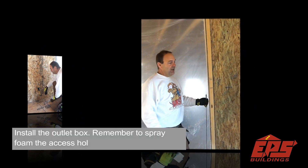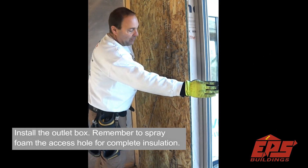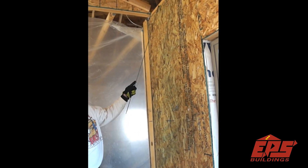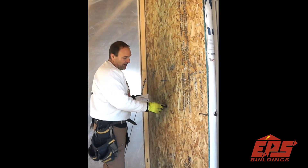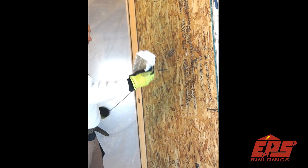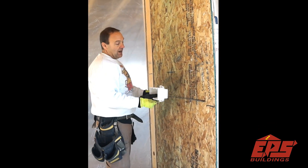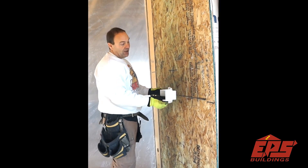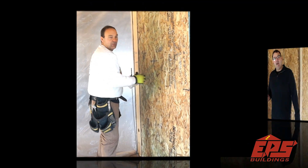So in this situation right here we are going to be cutting a three gang box in right here. It is not at the operating panel at the patio door, so there is not a chase right here. Our chase is over here in the center of this panel. So we are running our wire down here. What we can do is simply drill a three and a half inch hole saw right here to pop this out. In that situation then we would simply use a flex bit right here, drill through this hole right here and over to this box. So even though your outlets or switches don't match up with all your chases, it's all a simple project — just one extra hole right here. Popping this hole doesn't do any harm at all. In fact once you're done you can foam it and just pop it right back in.